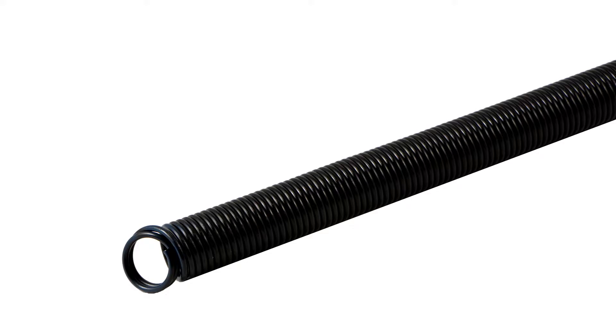These ASTM standards spell out the tensile strength ranges for each wire size. There are two types of oil tempered wire: Class One and Class Two. The garage door industry uses Class Two, which has a higher tensile range. Hard drawn wire is similar to oil tempered wire but manufactured with fewer steps, producing a lesser grade of wire.